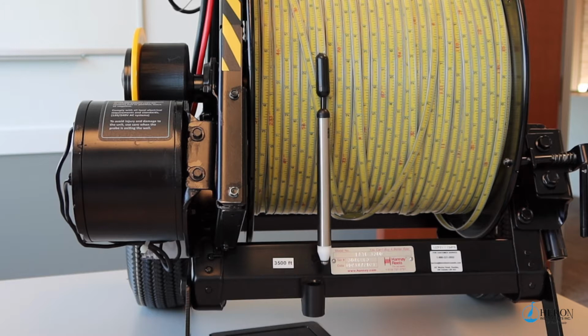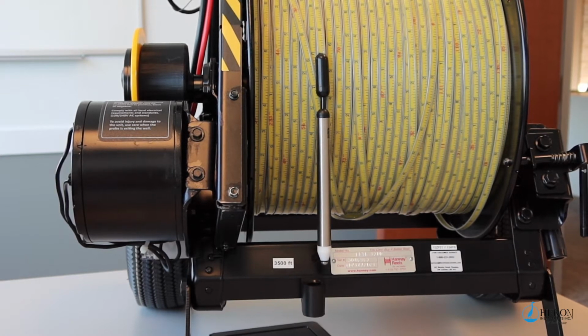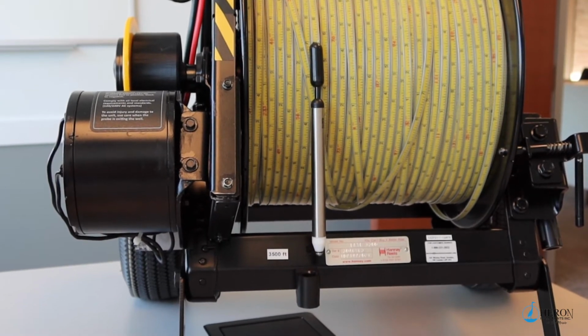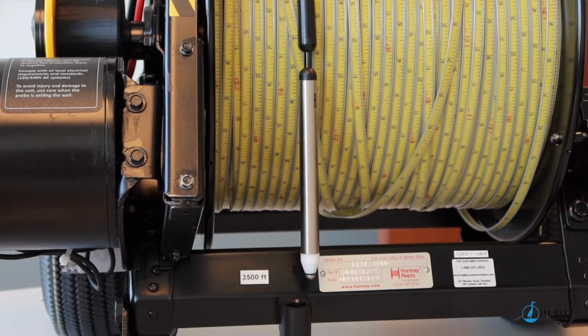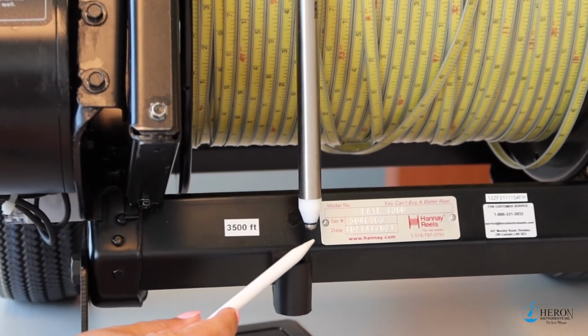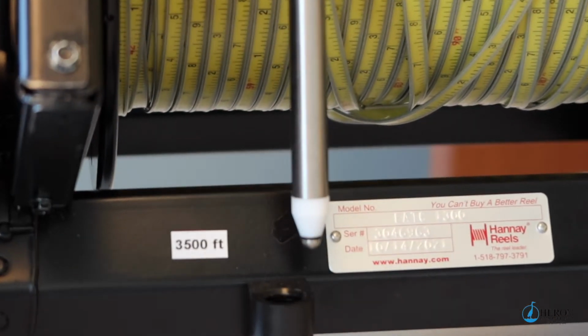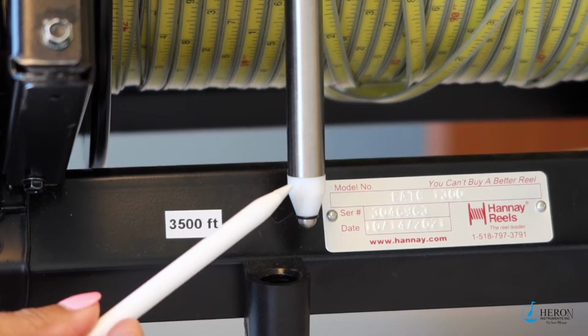The LongLiner comes with a fully submersible, permanently affixed modular water level meter probe. This probe is used to detect both static and drawdown levels. When you lower the probe into the water, the unit will start to sound immediately. Please note that you need to have both the stainless steel end as well as the start of the probe body in the water. This creates the contact. The 0 point starts here.